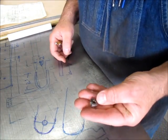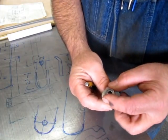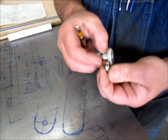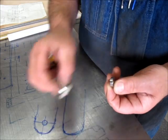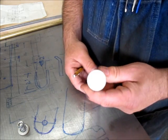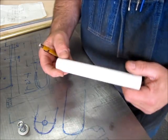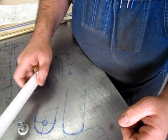I've got a little bearing here — this is a quarter inch ID and five-eighths OD, close enough for what we're doing. It's a little shielded bearing, should roll nicely, and it's skinny enough to sit in there and still have a little step shoulder. I've got a little piece of Delrin here — white Delrin. For folks that haven't played with this, this is a machinist's friend. Delrin is easy to machine, holds size, and it's hard enough and durable enough for lots of projects.